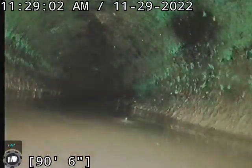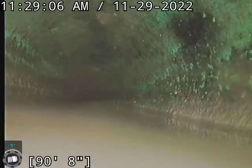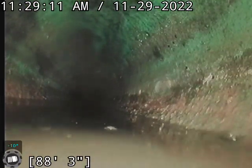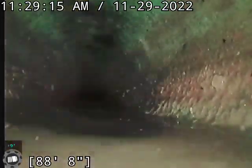You can see on the sides of the piping here we've got quite a bit of sludge and grease buildup as well. I'm going to recommend we start a Bio-1 regimen on this. That Bio-1's got natural enzymes and bacteria in it that'll actually start eating that grease and sludge up.